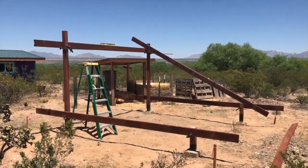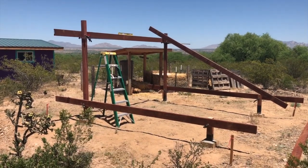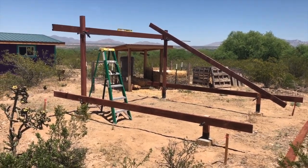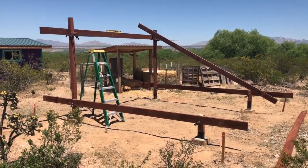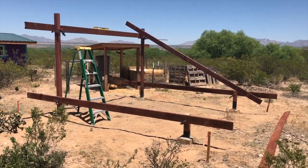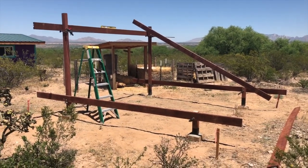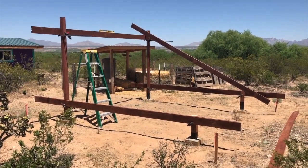Here we are the next day at the solar mount site. Looks like I've done more than I actually have — all we've got is the four posts concreted in from yesterday. I wanted to come out and check the geometry. I've drawn this up in SketchUp to get all the accurate measurements and an accurate count of materials. But one of the things SketchUp doesn't really do for me is account for the fact that this ground isn't a perfectly level, flat floor — it's not the same. So in SketchUp I could measure up an exact amount to the top of these posts, but because I'm out here on a real sloping ground with imperfections, I have to sort of change that.